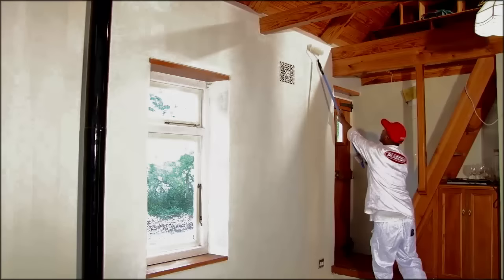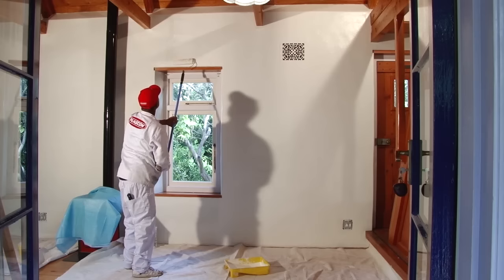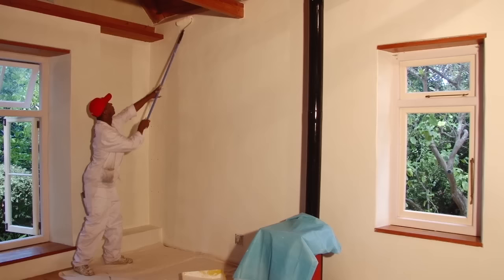For the second coat, repeat the process in the same way as for the first coat — cutting in the edges all the way around the wall. The rolling stage is next and is also done in the same way as for the first coat. The roller should have just enough paint on it; don't try to overload it, and when it shows signs of needing more paint, dip it into the tray for a recharge. Working this way is quite easy once you get used to it. Standing straight up while painting a wall is less tiring and you don't have to bend to recharge the roller.